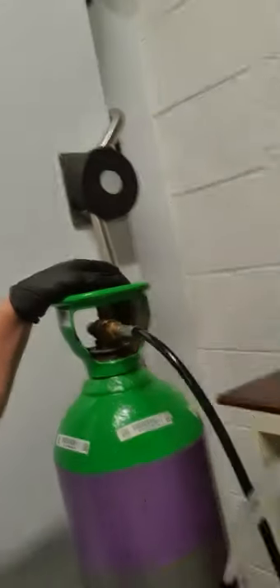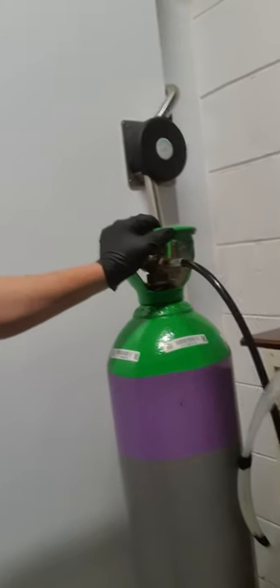Here's the basic system we use. We have big commercial bottles of gas — this is Easy Gas or Irish Oxygen for the commercial side. They also have small cylinders which we're an agent for — those are 10-litre bottles and they'll do 10 to 12 fifty-litre kegs something like that. Let's just run through everything quickly and I'll show you how to set up a regulator.